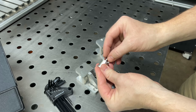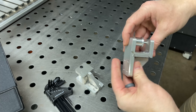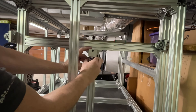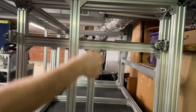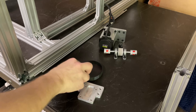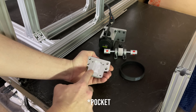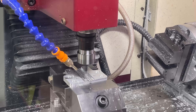Let's install this one. I have a shoulder bolt here. Let's install these on the machine — the belt tensioner is going to go right here in between the belt. I kept it separate from the other brackets because I wanted them solidly mounted, so I'll be able to just slide it up to put tension on the belt. The one on this side is going to go over here. I was able to order a slightly longer belt — we'll wait a couple of days for that to come in. I also discovered that I forgot to edit this slot — it's supposed to extend all the way to the end to give access for the belt to pass through. So I'm going to throw that on my milling machine and notch that out.